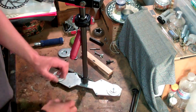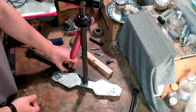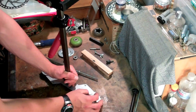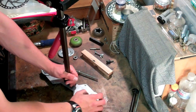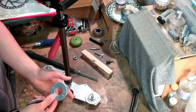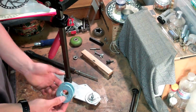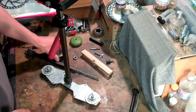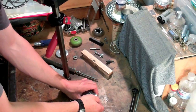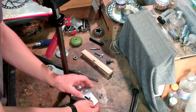For the weights on each side, you need equal amounts of weight, determined by the camera weight and the size of the whole device. I used a couple of big washers from the hardware store, attached to the base plate through holes with wing nuts. I weighed them out to be about the same — roughly 70 grams each — and drilled some holes in the ones that were a little bit heavier. You can attach as many as you need when balancing your camera, fastened on with a nut and bolt.